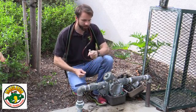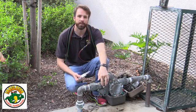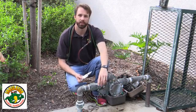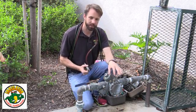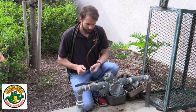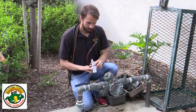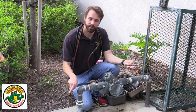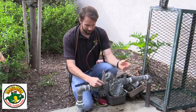First thing I need to do is bleed the test cocks. These are the test cocks — one, two, three, and four — and they're only used for testing, just for hooking my gauge up. We bleed them to knock out any foreign material and make sure they're working. On the RP, the reduced pressure, we have to bleed in a certain order. Since this plays on a difference in pressure, we always want to make sure our inlet pressure is higher than our outlet pressure. So I've got to bleed them starting with four first.